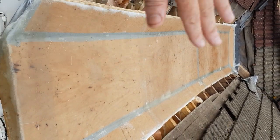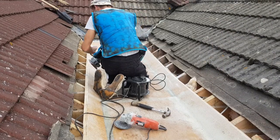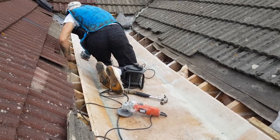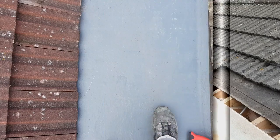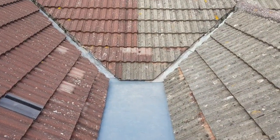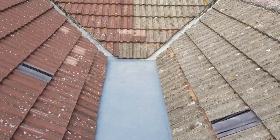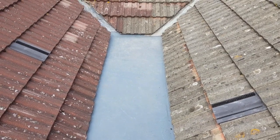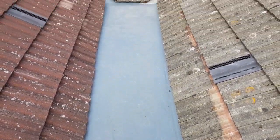Once it's painted that'll look really nice, then we can redo the cement work on the verge at both sides. All the tiles are back in, just need to cement up the two valleys and the verge, and that's it - all done. We have a seamless box gully that doesn't expand and contract like lead or felt, won't split in cold weather, is more durable and easy to keep clean. Hope it gives you a little insight and maybe you can tackle the job yourself.